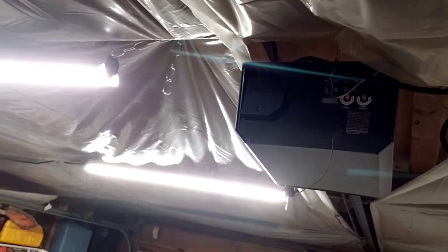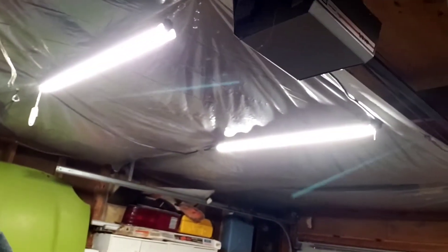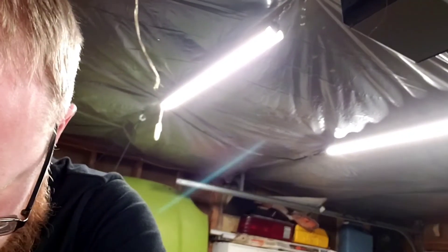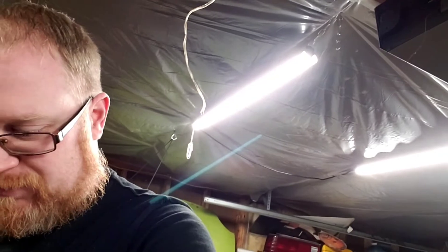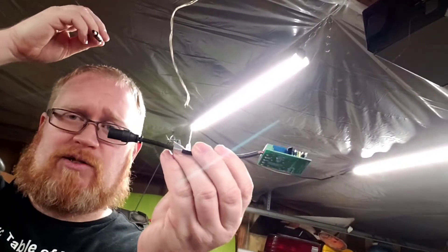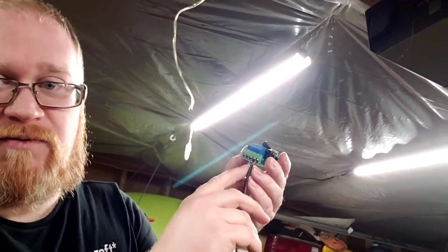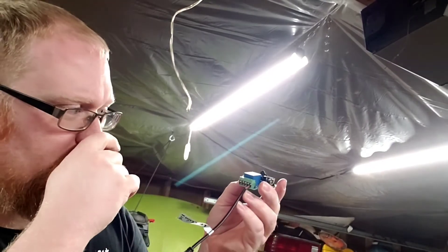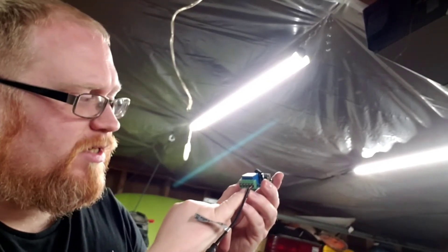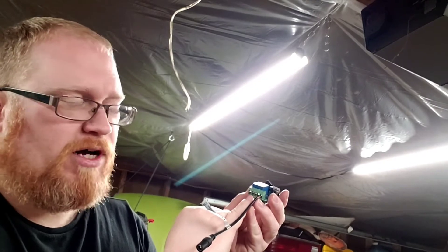Here's what we got on the back of the garage door opener. The two wires that normally go together right here — this little thin wire is what's going over to the button on the wall. I added a piece of speaker wire that's gonna go up to where this little device connects. I've got another power adapter here that has the barrel jack on the end, and a little female barrel jack saved from some LED lights. Red's positive, black's negative, and you've got in negative, in positive, and then three contacts for the relay: NC is normally closed, common, and NO normally open. We're using NO and common.